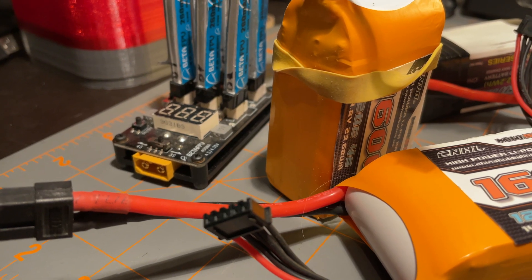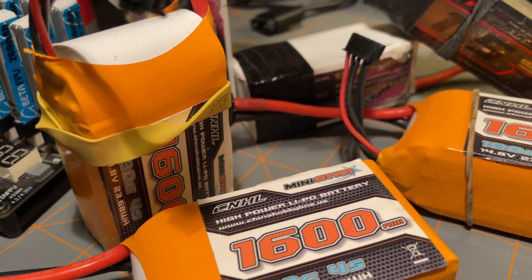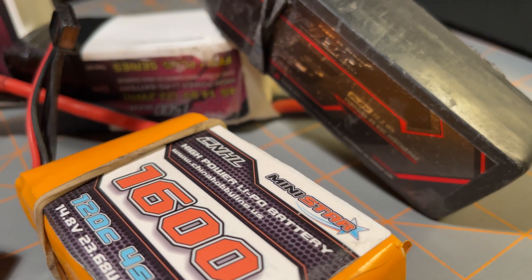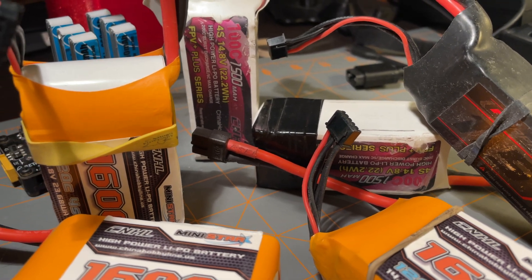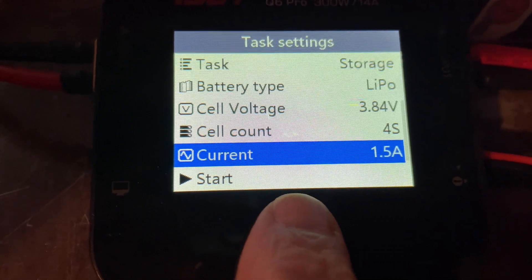Another thing you need to know is that you should not leave batteries fully charged for any longer than you have to. Once a LiPo battery is charged, it's best to use it relatively soon and then return the battery to storage voltage once it's done. A battery not at storage voltage is constantly degrading over time, and that damage is cumulative. For example, a battery left at full charge for a month may have greatly increased internal resistance, and when used it will cause decreased performance and an increase in heat created. There is no magic number for how long to leave a LiPo fully charged — leaving it for one day 10 different times is the same as leaving it fully charged for 10 days in a row. Most people find that leaving batteries fully charged for a day or so is acceptable. If you find yourself with fully charged batteries and no plans to use them in the next day or two, it's best to discharge them down to storage voltage.